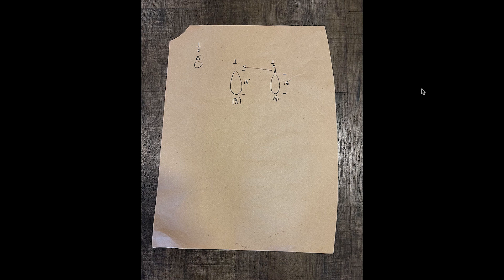Let's look at the template and see what we know and what we don't know. The outside edge fits exactly where they want it. That looks straight — it may be perfectly straight, probably not. That's definitely a curve. We've got a fairly straight line here and one here and a little radius there. We've got some stuff drawn on here — here's the center point side. On this center point, we have a circle center that looks like it's an inch and a half, and I think that's for a dimmer switch in this truck. There are two ovals here centered, and I think in the old vehicle the brake and clutch pedals came up from the floor — that's probably what that's for. We also need to add a cut here and here because the pedals don't come off of here, so we'll have to be able to lay that flat.